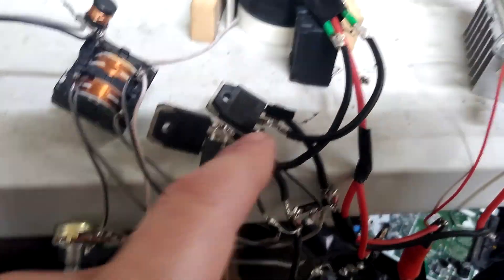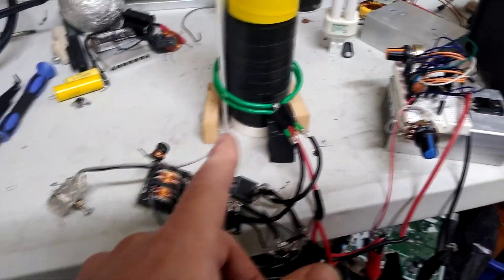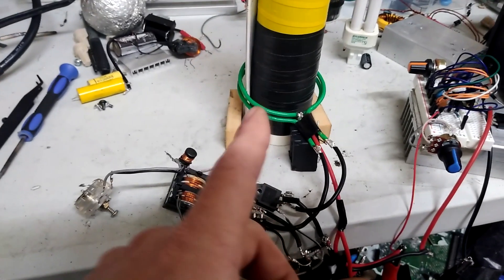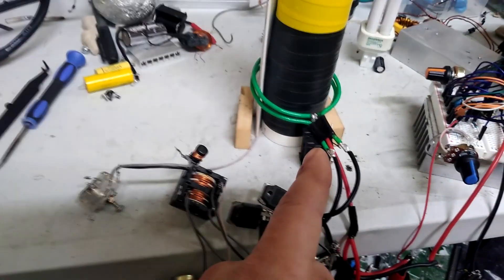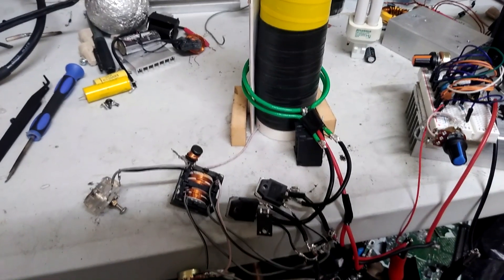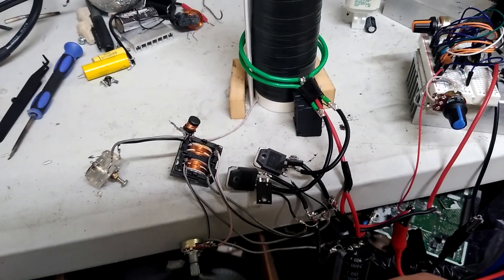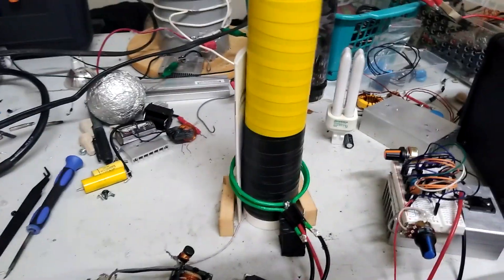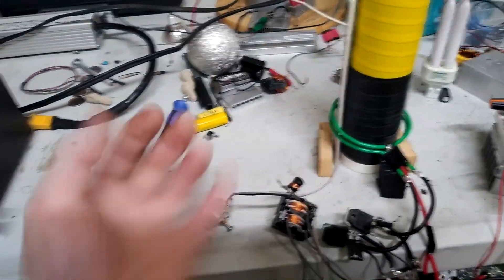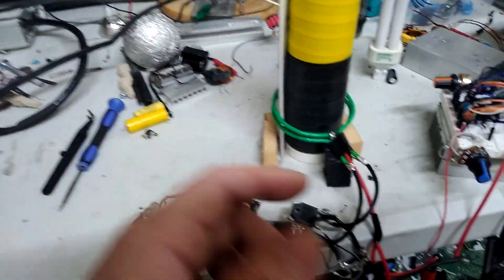I've got a really complicated part name on them, but upon seeing I could get some decent arcs, I wasn't able to reconcile the drive part of the circuit with the interrupter part of the circuit. That was mainly because the way I had this circuit working wasn't really quite how it was supposed to. It would surge high amps into a very fast discharge at the top load, but as far as a continuous wave run mode it just wasn't very good at all. Basically the idea was to pulse it at the power rail with a capacitor reaching a high enough voltage based upon the gate tuning to trigger that pulse. That's why from the ZVS supply it worked pretty good — I've got a run capacitor on the output doing that pulsing, but it's not able to recharge at lower duty cycles fast enough for a continuous run.